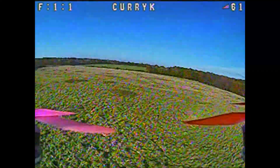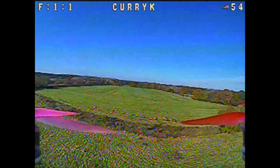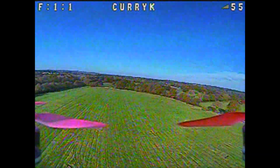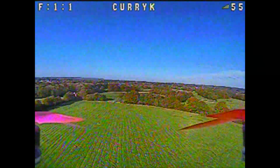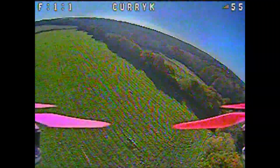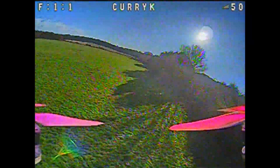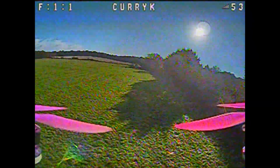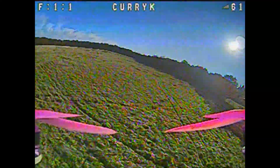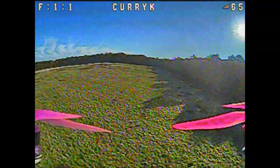That's what the microphone sounds like — when there's low amounts of noise it sounds pretty good, but as soon as the props spin up heavily it just seems to overwhelm it. I wanted to show this specifically because I thought it was outstanding performance on 25 milliwatts — you can see F11 in the corner so this is just 25mW. I was more worried at this point about the control signal being lost with RSSI going pretty low, but normally I'd expect quite a bit of noise and some snow starting to appear. This is really really good — out about 500 meters without displaying any problems.